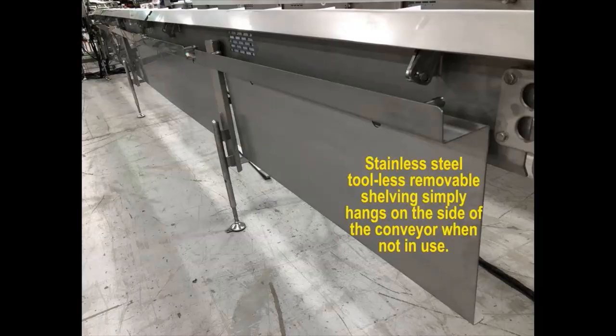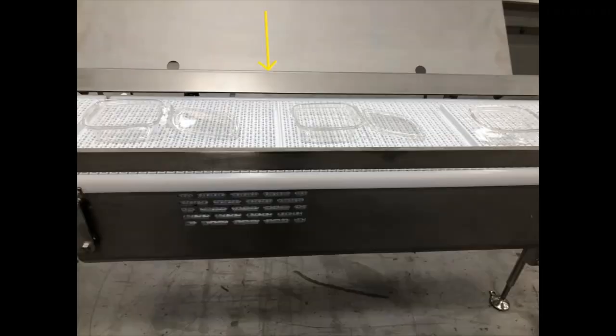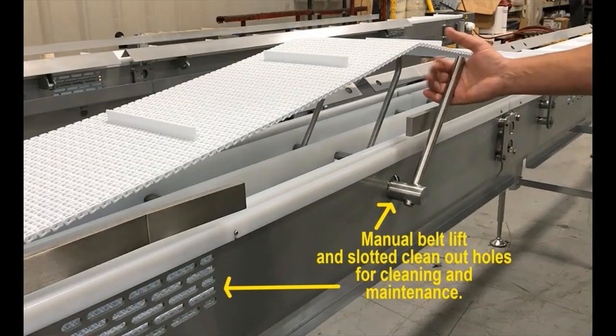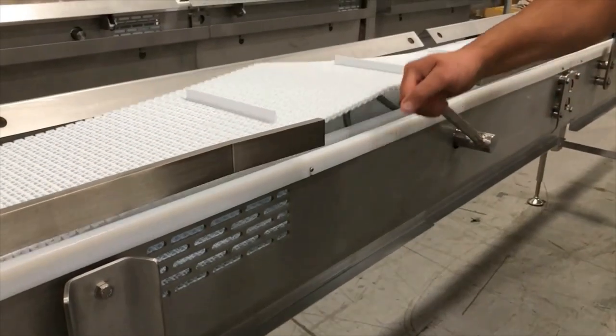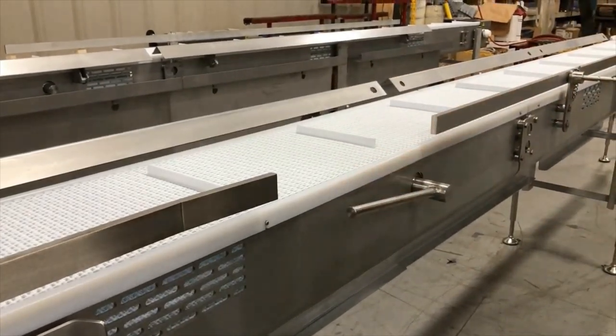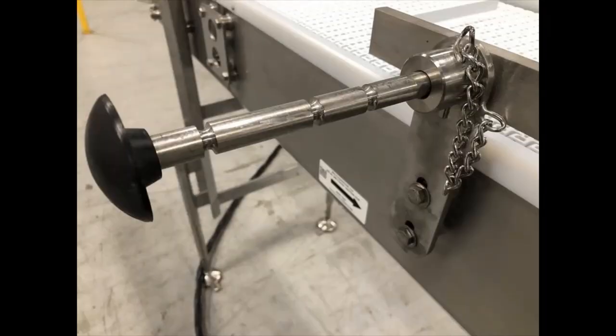Shelving is provided for product storage containers that are easily positioned for operators to slide bulk food directly into clamshell style trays and for manual lid closures. Other features incorporated include manual belt lifts, slotted clean-out holes for cleaning and maintenance, and manually adjustable guide rails with pre-set positions for specific width openings and product changeover.